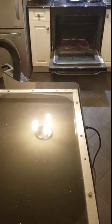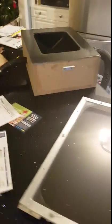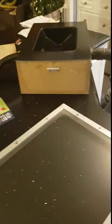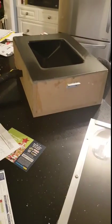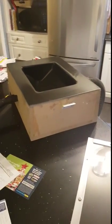It'll sag to probably about two or three inches below the aluminum frame, and then I'll pull it out promptly and place it on the mold with the vacuum cleaners both turned on. I have two hooked up here — a shop vac and a smaller canister household vac. From experience doing the 1/8 inch acrylic, that was sufficient with the addition of a few larger tooling holes in the corners to draw the piece right down into the corners.